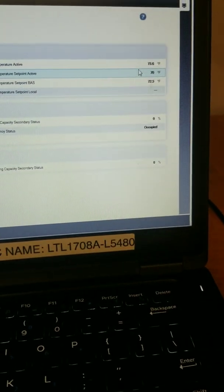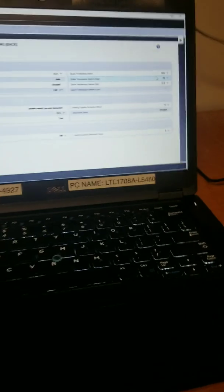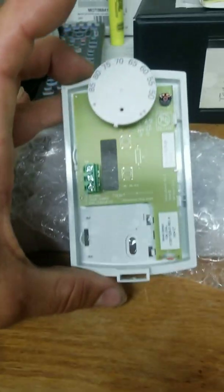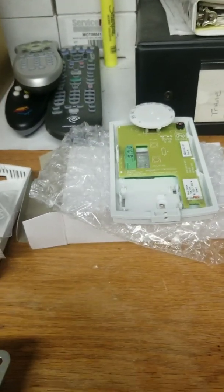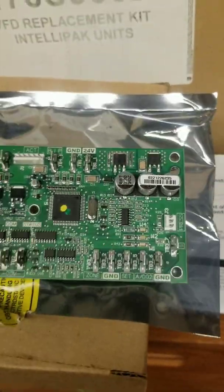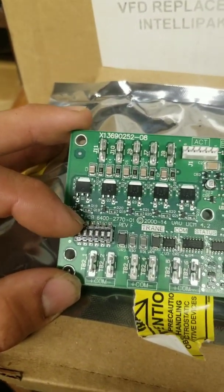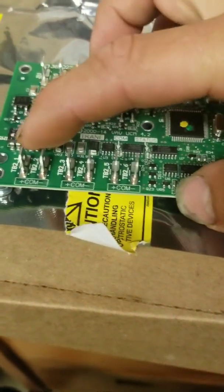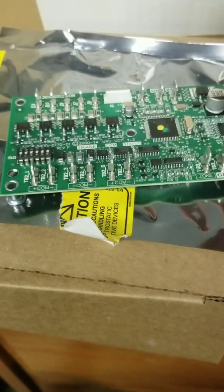Space temperature is 73.6, so we have a damper issue. Basically we have a three-story building with a 100-ton rooftop unit controlled off a VFD and static pressure. Each VAV box has a 24-volt actuator, a space temperature sensor, and a thumbwheel to control each space. I believe there are about 40 boxes in this building, each with a unique address for communications. It's basically a daisy chain system — communication in and out, one box to the next.